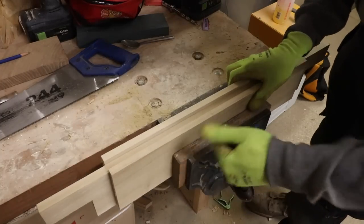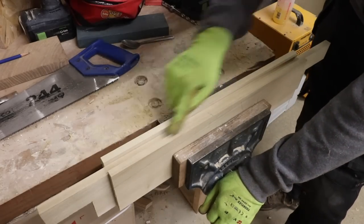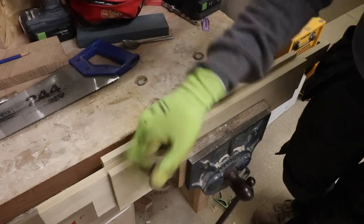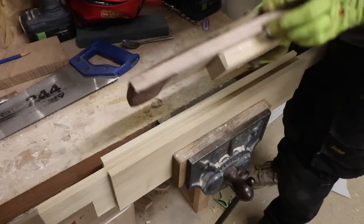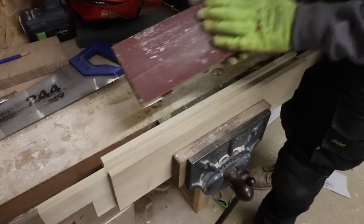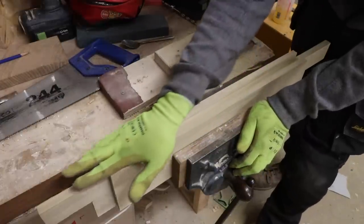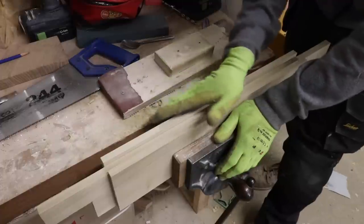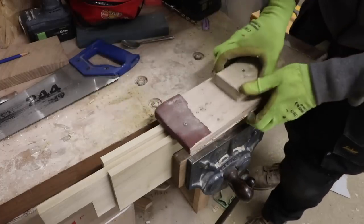Another thing we can do while we're waiting for the panels to dry with that paint is just sand all the inside edges so there's no planer ripples or saw marks or anything on them, the difficult to reach and difficult to sand inside edges, before we glue it together. Normally I use a pad like this, so a flat backing pad with some 150 grit or 100 grit paper in it, and just work it in by hand. All that allows you to do is keep it perfectly flat across this way and perfectly smooth along the face or the edge of the door, so that where the joints are, you're not rounding a corner off. Whereas if you use something like an orbital sander, you tend to get a rounding effect on these edges, and that will show in the joint. So something like this will keep it nice and flat.